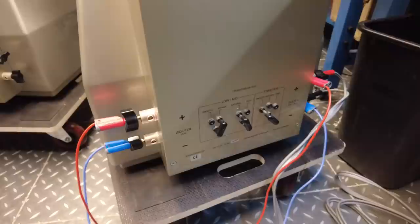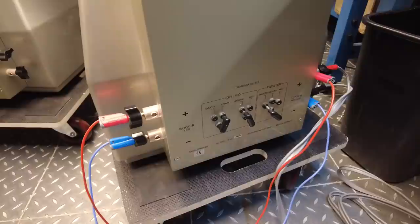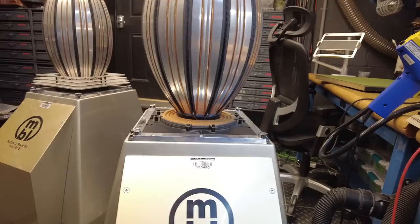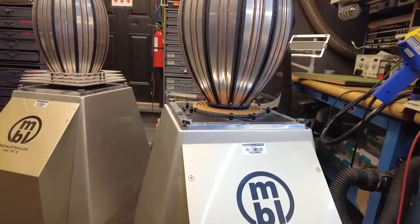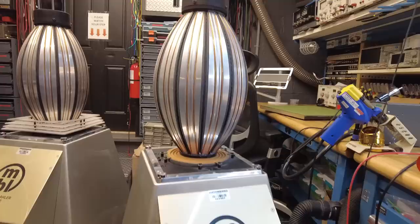The first thing I notice is the bass is pretty low and pretty steady, so I think we've got a good bass driver. I've got a slight rattle right around 1 kHz, or just below that, so I'll have to investigate — it's coming from this driver here. I need to dial in the exact frequency and make sure it's not resonance or something else vibrating. You can often be tricked into thinking you've got a bad driver when all it is is that the driver is exciting some other item — it could be on your workbench, a light fixture, a shade.